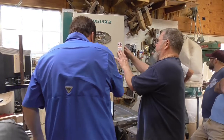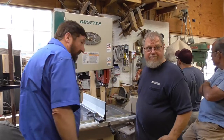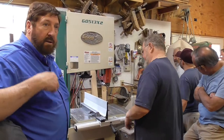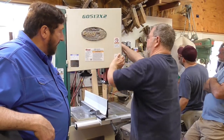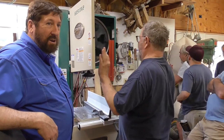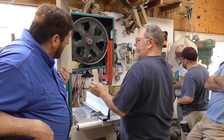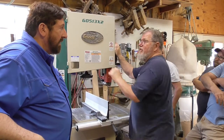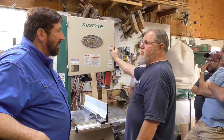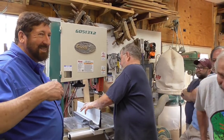See, there's a hole in most of these breakers here. Turn the wheel by hand, Mike. Always turn your wheel by hand. Make sure everything's loose and free and you didn't leave something under there. Run a wire in between these bolts. Every once in a while, if you don't do that, you turn it on and the motor goes. Left a screwdriver in, not a good thing.